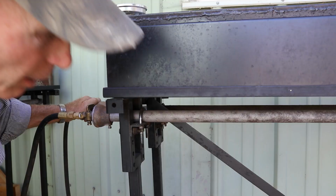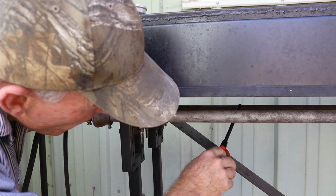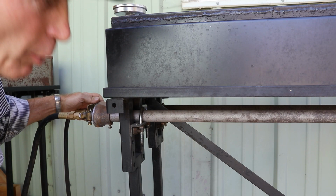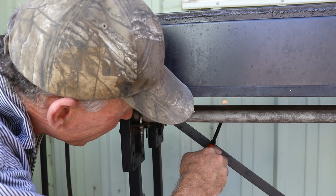Okay, so this pipe burner in the back is for our bluing tank. Now, it's a larger pipe. It's got two rows of holes because it's going to have to have more energy. We're going to have to get that tank up to a rolling boil at about 290 degrees roughly. And we'll get more into the temperature and temperature control here shortly.